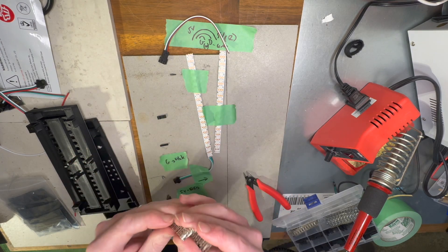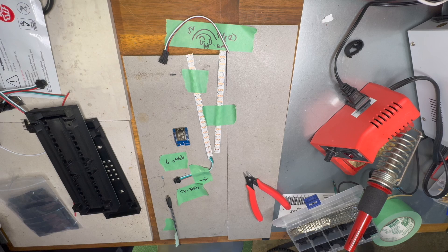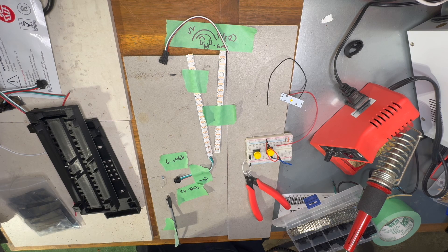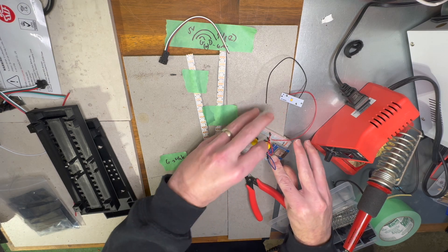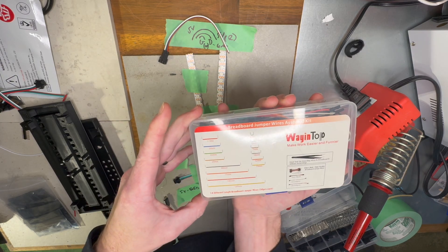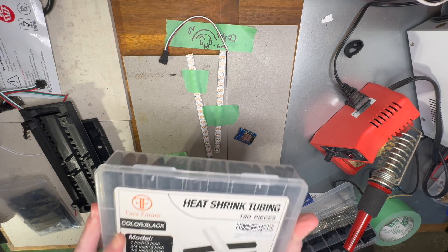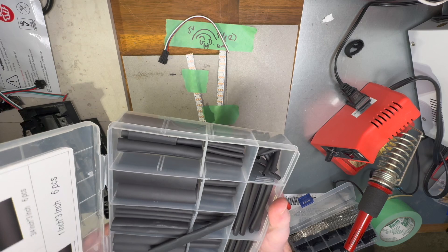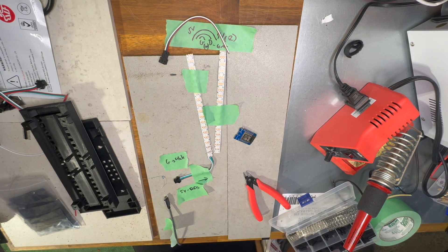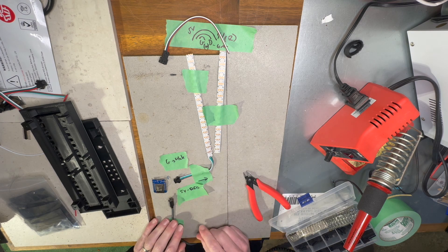These connectors come with little pins which you crimp onto the edges of your wires. That's an option if you want to work with a breadboard — you can connect your Wemos and hook it right onto your breadboard for development, adding buttons or lights. If you want to do breadboard work you might want a box of jumper wires for those connections. If you want nice-looking wires without exposed metal, you might want to get some shrink tubing that you can use a heat gun or lighter to wrap around your connections once they're made.